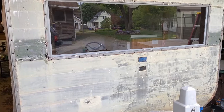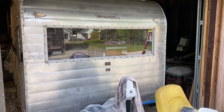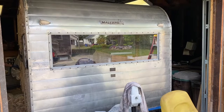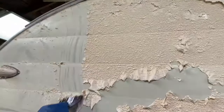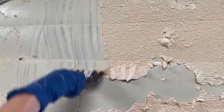After the paint came off, what I found works well is to make sure it doesn't dry out — once it dried, it got really hard to take off. So I put another layer of Citrus Strip on and then it came off. Then I ended up scrubbing it with a plastic scratchy washcloth with hot soapy water, and finished with a coat of quadruple-ought steel wool and a little bit of mineral spirits. It's not a polished finish, but that's not what we're looking for. I'm really happy with the way it came out. The paint just slides right off — literally nothing left. It leaves behind a light yellow residue, which if we let it get dry gets really hard to take off, so we scrape fairly quickly and then start scrubbing it clean.